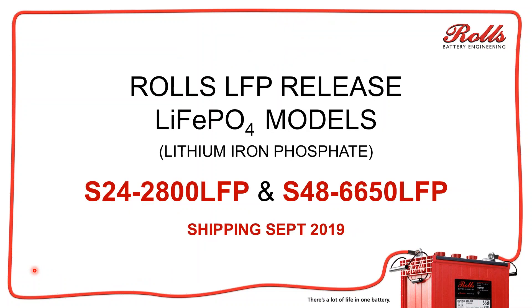The next batteries we're going to talk about are our new lithium batteries. One thing that's been absent from our shows for the last few years — because we've been working on it and weren't 100 percent sold on it — was the lithium iron phosphate. We looked at lithium ion, lithium cobalt, and lithium manganese, but those chemistries were just too volatile to be putting into an installation that wasn't being monitored continuously. So what we did is manufacture two LiFePO4, or lithium iron phosphate, batteries: a 24-volt model and a 48-volt model.